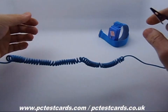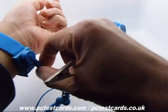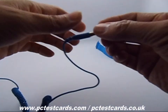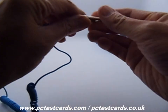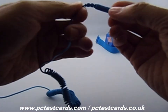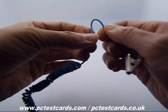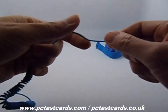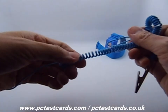The wire is sometimes very inconvenient to use — we have to swing it around during the repairing process, and also watch that the crocodile jaw is not losing contact with the grounding source. Sometimes the wire inside may have broken and will totally lose the grounding effect, and we will never know which spot in the wire could be broken.